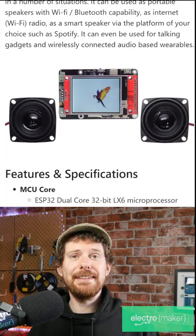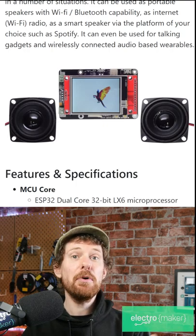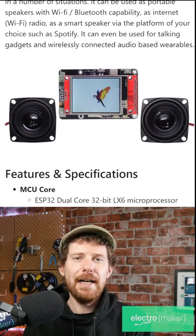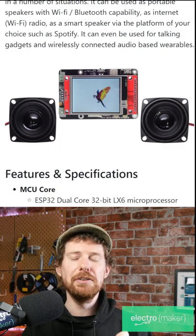The second thing I find super exciting about this is the choice of DAC they've used. This is the Maxim integrated DAC, the same one that you get in those little Adafruit breakout boards that loads of people have made fantastic projects with. It is an I2S DAC that will turn your bleep-bloop machine code into audio.